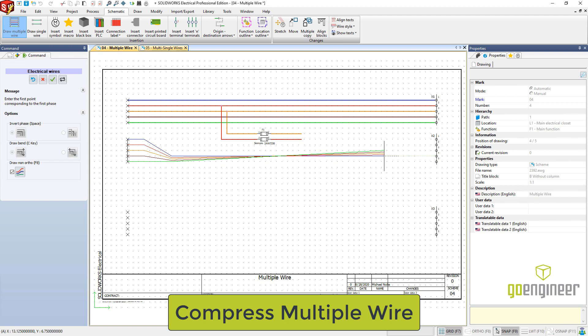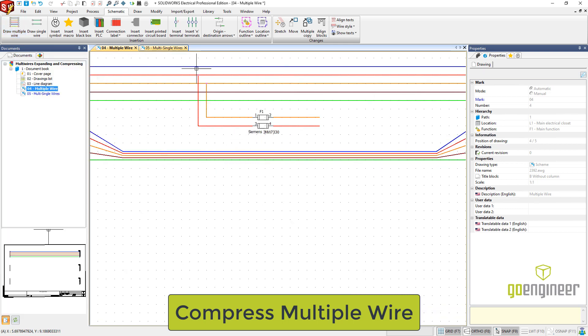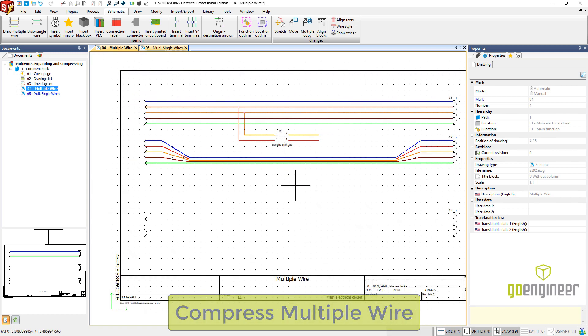I'm going to get past my other area and line it up so that the blue line is horizontal. Yes, the wires are crossing, but just be aware of that. I'll click top, come down, and do bottom. Then to wrap this up, I'll go top and bottom and finish it into the terminal on the other end. When I'm done, I can hit the green check mark on the left hand side, or do a right-click mouse button, and that gives me my run. When we zoom in — and yes, I did make the lines a little bit wider — they are still discrete wires, still individual wires, not touching, not merged into anything. This is how SOLIDWORKS Electrical needs to operate for the wires to be identified as different from each other.